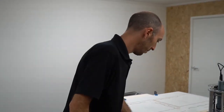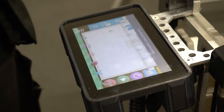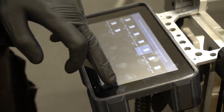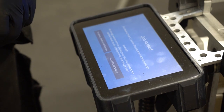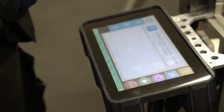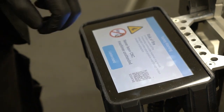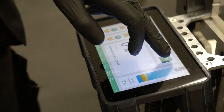Now I'm ready to load my second job. I'll go into the file loading context, push the file open button, find the second operation file, say yes, and agree for it to check for errors since this is the first time I've run this file. It says the file's okay — I press finish. Now I'm just going to repeat what we've done before: press the green play button, accept that it can lift on pausing, accept the safety screen, and then press go.